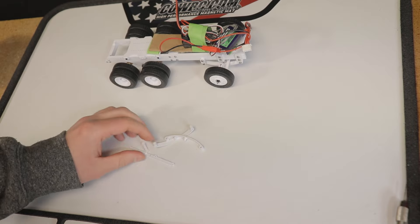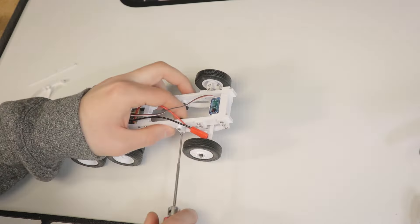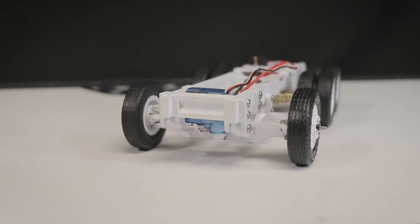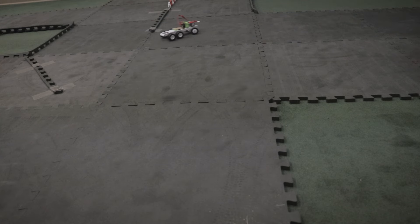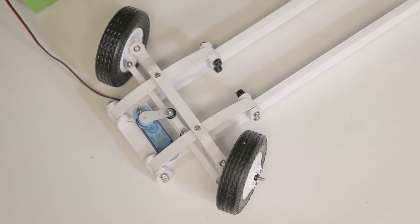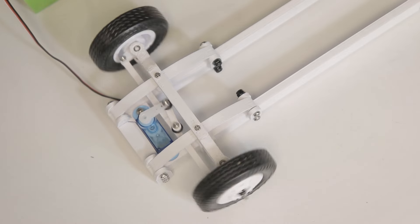Back over on the bench, I've got some new parts to install. A lot of these parts aren't really too exciting — mostly small tweaks such as making the leaf springs a bit thinner to allow them to flex more. I can probably make them even thinner, but the front suspension is certainly softer now with these installed. I'm also working on adjusting the steering components. This truck will be able to turn quite sharp — not exactly drift car levels of steering angle, but certainly sufficient. I want to make sure the steering components can't come into contact with the leaf springs, and it's nice to observe it in physical form to confirm everything functions as it should.